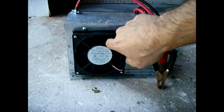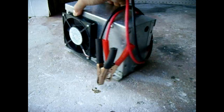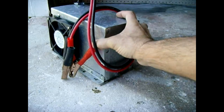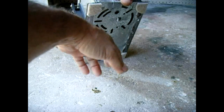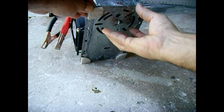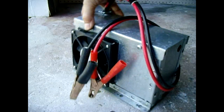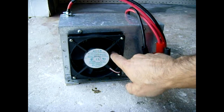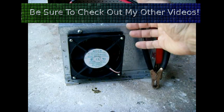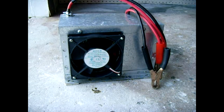This fan was removed from an old desktop computer. I cut a big hole in the middle side, and there's a small hole on this end. The bottom has a whole bunch of holes — I took a plate from a lavatory light and soldered it onto the bottom of the unit. The airflow is drawn in through all these openings, past the transformer, and right in front of the fan there are two MOSFETs suspended by a bracket with their heat sinks, giving maximum cooling.